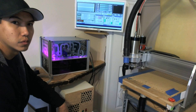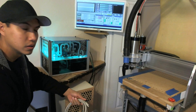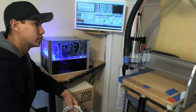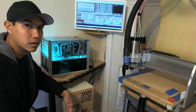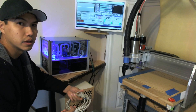The first problem I had was the cables. The cables coming from the G540 to the stepper motors were getting hot because the resistance they required was at the end of the plug. Plus, this wire is actually only 28 gauge, and the one I replaced it with is now 18 gauge.